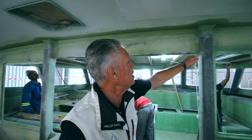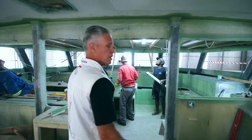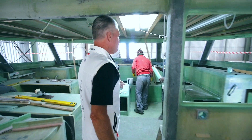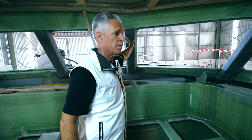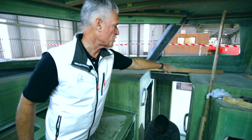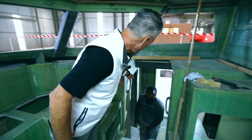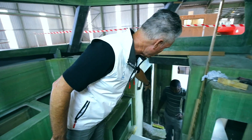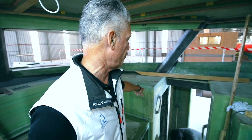This overhead beam — we use carbon on all the around cuts and all the end cuts. If you come inside the boat, you'll see that all of these beams that support the salon roof are made out of carbon fiber. You'll see structural areas are all in carbon fiber. Around all these bulkheads, it's full of foam core carbon fiber — carbon fiber rear and course bulkheads.